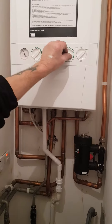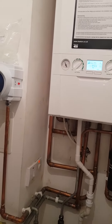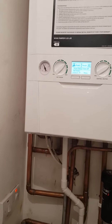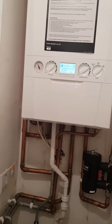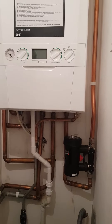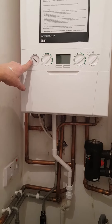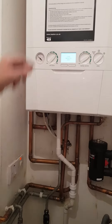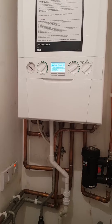At the front there's a pressure gauge. That should be kept just above one bar and below two — so around 1.5. When the boiler pump isn't running, it'll settle around 1.2 bar. Because the pump is running right now it's showing a slightly higher pressure, so I'll leave that as it is.